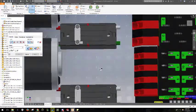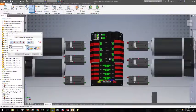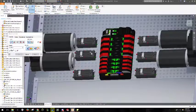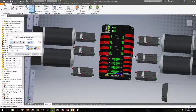And you can see that there's space here left for, for example, more talons. You can also put a Spark motor controller here, or a Victor motor controller here. So this is an expandable thing, but the idea is to keep the distance from the terminals to the motor controllers short, so that you can keep the wires short.